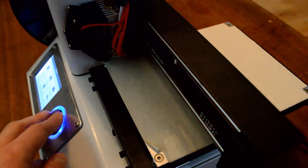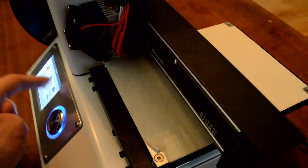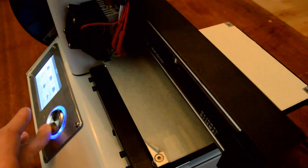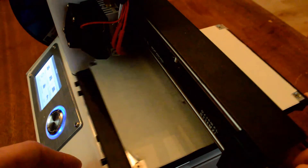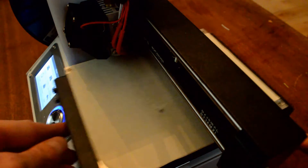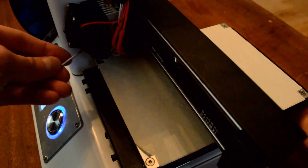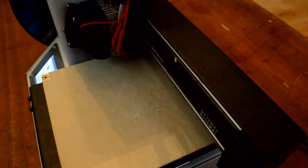What you should do is go to the Z-axis, click it, and rotate counterclockwise to lift the nozzle off a tiny bit. Then push the bed away, because when it's homed all the way you can't actually get the Allen key down to the screw. Move it a little bit to get access.